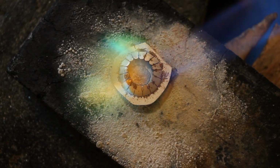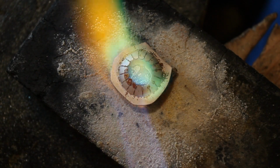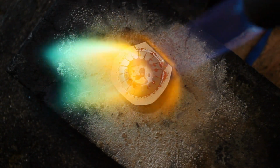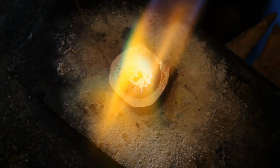And then here I'll just use hard solder, and I'm going to stick solder the top piece to the back plate. I could have used solder chips and probably saved a little bit of solder, but seeing as it'll go into my melt pile, I'm not super worried about the little bit of solder waste.